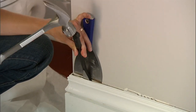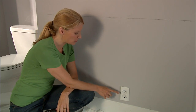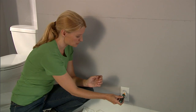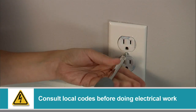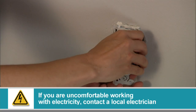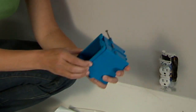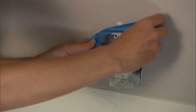There are a few things that will need to be removed. Carefully remove any trim in case you want to reattach it after you're finished. Now for the outlet — you'll need to remove the outlet cover, but before you do that go to your circuit breaker and cut the power to the circuit, then use your circuit tester to ensure there is no power. Then take your screwdriver and remove the outlet cover, and detach the holding screws. After you install your pebbles, your wall will be thicker so your outlet will need to be extended out as well using a box extender, which we'll cover in the next video. Then just cover your outlet and keep it clean and dry.